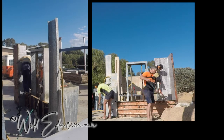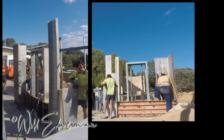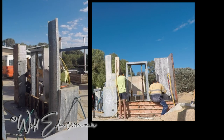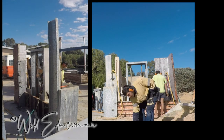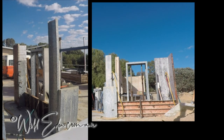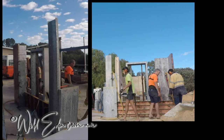Now, as you can see, because of that doorway in the middle there, we've got to shovel in. You can't put the bobcat right up to it. The boys are going to have to shovel in each section and then ram around. Now, because they're pillars, we have anchored the pillars to the ground. Again, there's a specific video for pillars and for anchoring that I encourage you to watch, and again if you're a paid subscriber you have details on exactly what sort of metal.